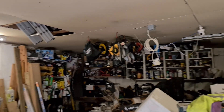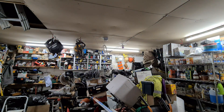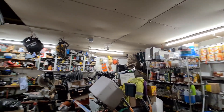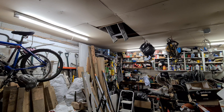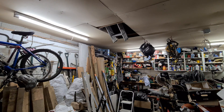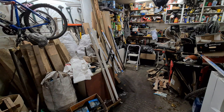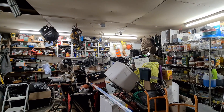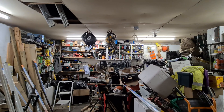Got that one done, now just replacing the two at the back. And there was light — immediate, no delay. We've now got four LED tube replacements: they won't smash because they're plastic, they're white light, they come on immediately, and they don't need to warm up. For a few minutes' work and a few pounds, we've got a two-thirds saving on electricity — so if I leave them on overnight by mistake, it won't cost nearly as much.